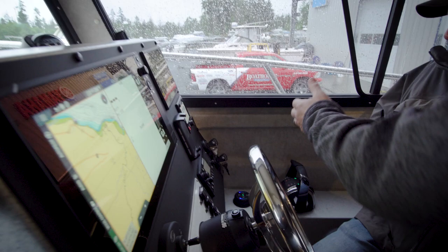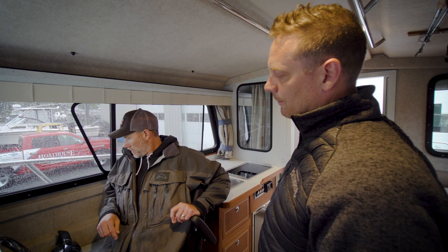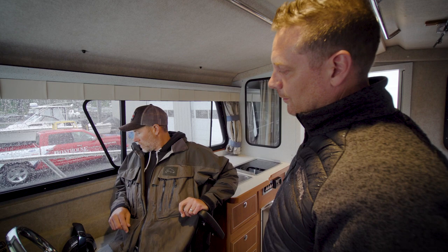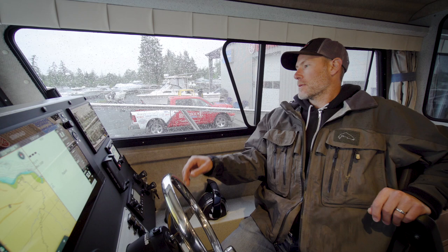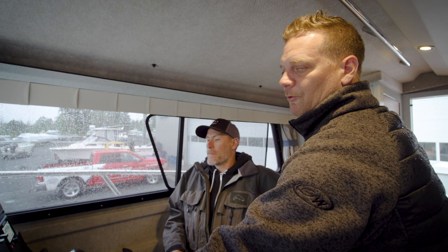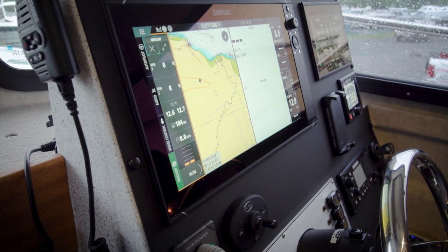When you're trolling, or coming back off your trailer, it's got throttle only and it's got the sync mechanism as well. It's a really, really good control that Mercury's put out — definitely one of our number one sellers. They're slick and smooth. It interfaces with the SmartCraft system and gives all your readings — fuel flow, RPMs — it's got so many little intricacies. This ties in with the Simrad system too. We can hit Mercury here and get all our controls — fuel consumption, voltage, RPMs for both engines. Trim indicator and speed all overlay on the back screen as well. It's all tied into one system.